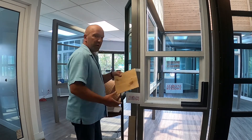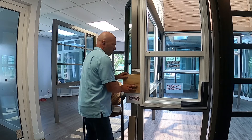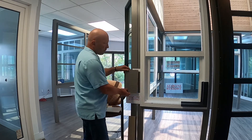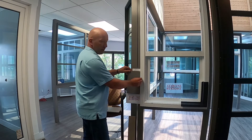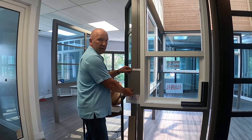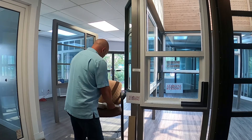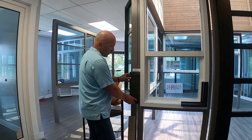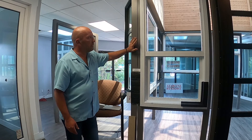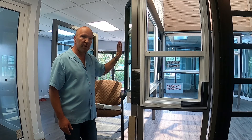Some exterior samples we have would be typical old renovation like a horizontal cedar siding — you cut out the side and just kind of force that in and it's finished, so there's no caulking line needed. We also have hardy board that can slip in there, and as you can see it goes in about five eighths of an inch, which gives it that reveal. You can put your exterior in there and just float it, allowing it to move with expansion and contraction. That's a great option, and last but not least this is basically a finished product with hardy that would insert there. The great advantages of the PVC factory installed and factory finished brick mold from Starline Windows is it also comes with a smart side cutout to adapt to the exterior you're choosing for your home.